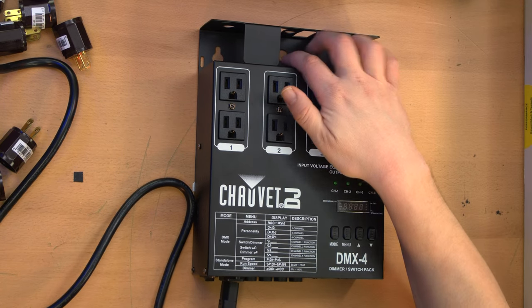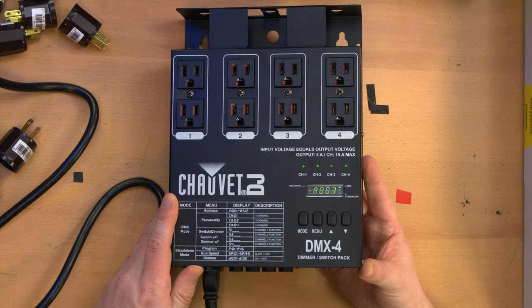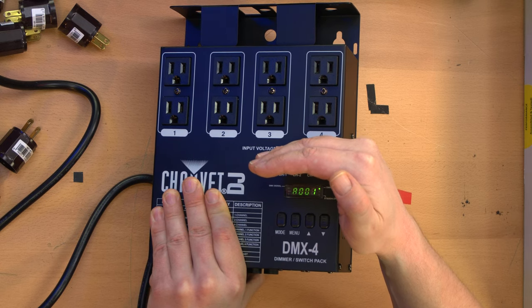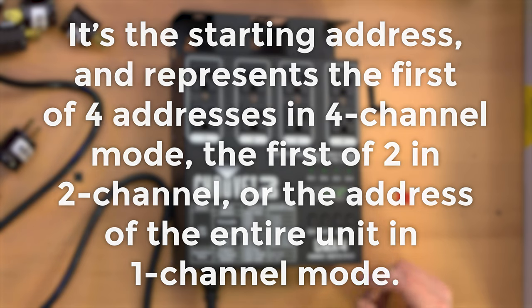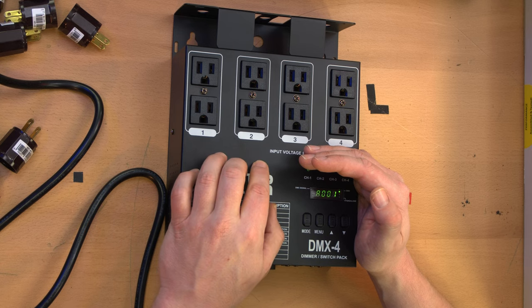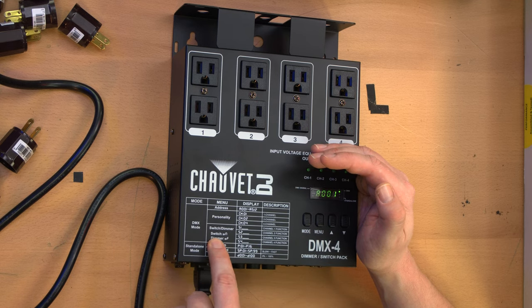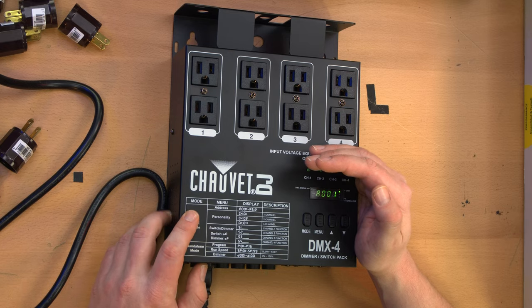The best thing to do right now is to power this on. There is a power socket on the bottom as well as an on-off switch for the whole unit. The display has lit up — it's set to AU001, which is the address. I'm going to assign each of the four units different addresses: this one will be 1 to 4, the next 5 to 8, etc. Going through the menu: S1 is on — switch functionality is on as opposed to dimmer. Switches 2, 3, and 4 are also on, and we're on address 1. Seems pretty straightforward.